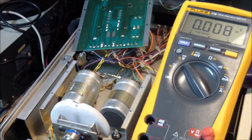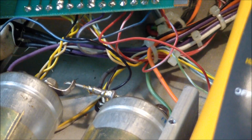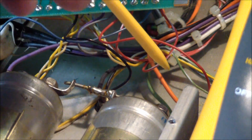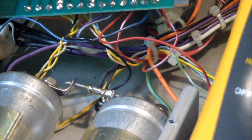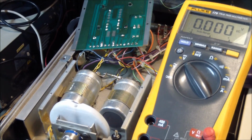Okay, I lifted the circuit board, which is called circuit board number 3, and we see we have 2 computer grade caps here. I have a common ground and then plus or minus, I don't know which is which, but that's the unregulated voltage, smooth unregulated voltage. So let's have a look and see what these output. Now my guess is, since we're regulating 15 volts, it'll probably be somewhere around the low 20s, what we should be expecting out of here.